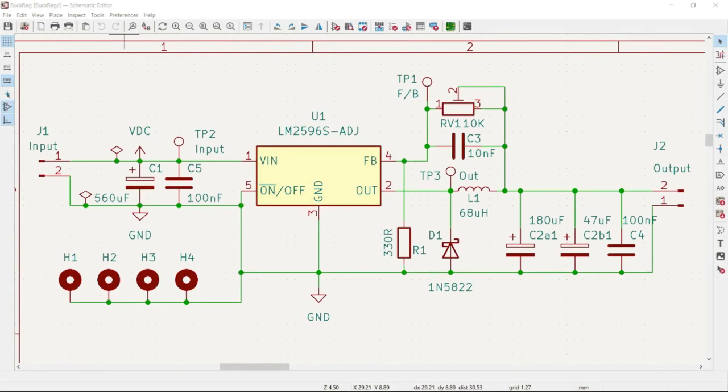I had to insert this little piece of the video after the whole project was complete, and if you look carefully you will see that the schematic has actually been modified and corrected. The one that was used earlier, as I've intimated in some comments, was faulty. Resistor R1 was supposed to go from pin 4 to ground, which has been corrected on this particular schematic here.